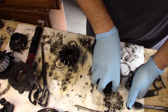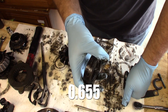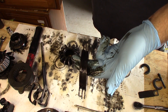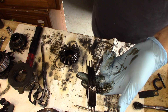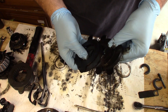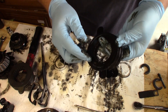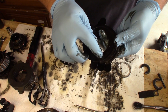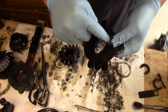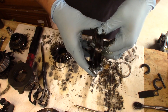The optimal shim pack thickness for a new shim pack is 0.655 inches. This particular pack measured 0.6435, so when it went in it could have been the proper thickness, but over time it wore down and it's obviously not the proper thickness now. There's a good 10 to 15 thousandths in there that isn't accounted for, where the gear was rubbing up against it.